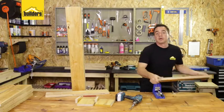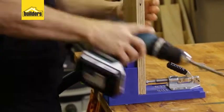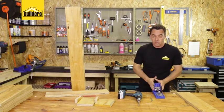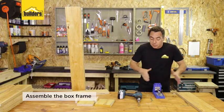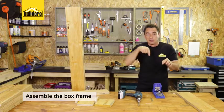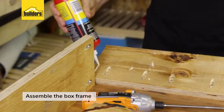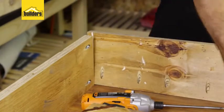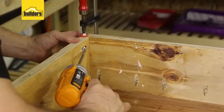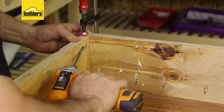Now I've got my two end pieces and I'm going to put pocket holes on either side on both pieces — that's the pocket holes done for the box frame. Now I'm going to start assembling it. We're going to build it on top of our bench, put the slats underneath, and then screw those down. Remember, it's always a good idea to put some wood glue between your mating surfaces. Clamp into position, insert your Kreg screw, and you'll see how it pulls those two pieces of timber together to make a secure joint.